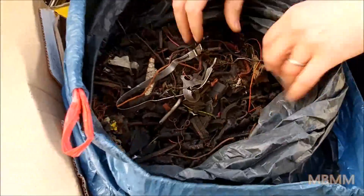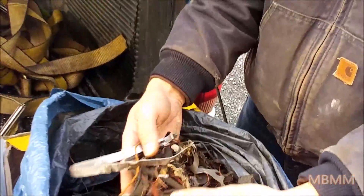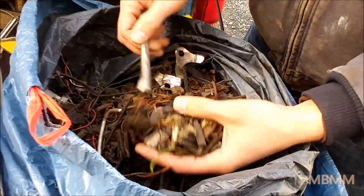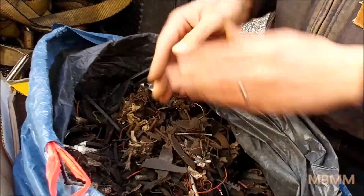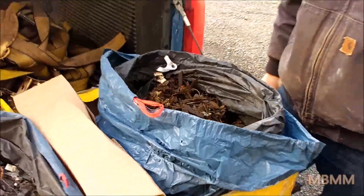And this is the third sample he sent, which is mostly rubber and plastic. There is some copper wire in here, and a little bit of ferrous and probably aluminum as well. So we're going to run it through our HD hammer mill with a half-inch screen and then under the mag belt, and try to pull out as much ferrous as we can, and we'll show you what comes out the back side.